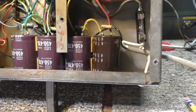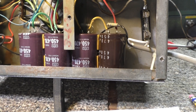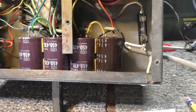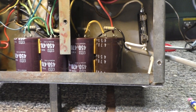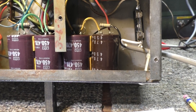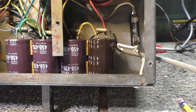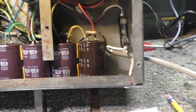And often you will hear pow — a big giant boom explosion like a shotgun — and the magic smoke comes out. A lot of times if you've ever had a filter cap explode like that, it's like boom, what the frock? That's what happens when you put direct high-voltage AC on an electrolytic filter cap like that, especially a big one. They were going to have nothing but issues with this amplifier in that configuration, and they were going to have the shotgun explosion of the filter caps going boom. Look it up online — an electrolytic filter cap bang sounds like a shotgun going off.